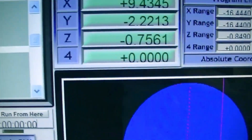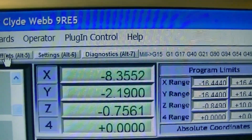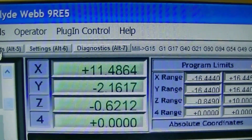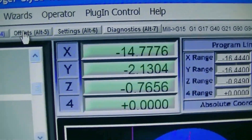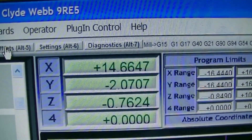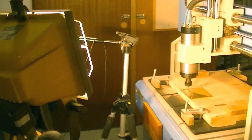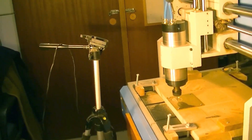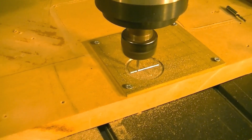I'd like to draw your attention to the figures here in X — this is in millimeters. If you approximately count every second, it's actually operating at 12.7 millimeters per second cutting speed, which is exactly half an inch in imperial measurement — so that's half an inch per second cutting speed. The spindle itself is rotating at 22,000 RPM. So in real time, this is half an inch, or 12.7 millimeters, per second cutting speed.